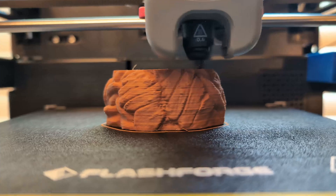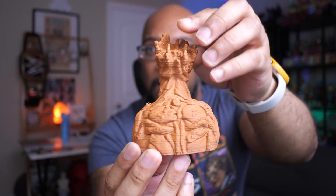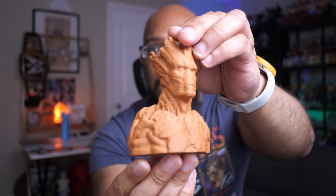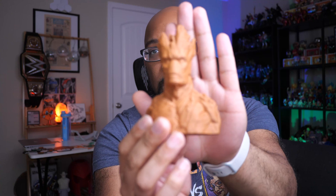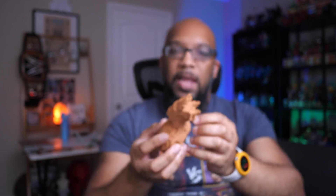I also thought: these are really small things, and with larger nozzles you don't get them for detail — you get a larger nozzle so you can get things done faster and lay down more plastic quicker. So I wanted to print something bigger to see what happened. I found Groot — older Groot, the first Groot from Guardians of the Galaxy. Although he came out okay, there are still these layer lines, almost like they're due to speed moving a bit too fast. He also had some stringing on the top, so I hit it with the heat gun, but there are still some little imperfections here and there.